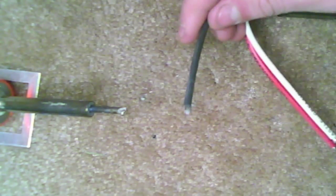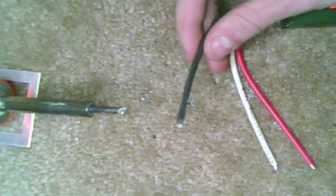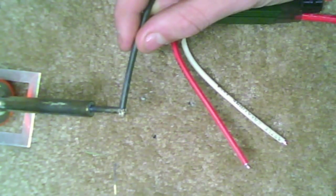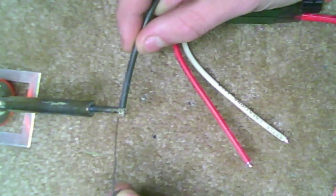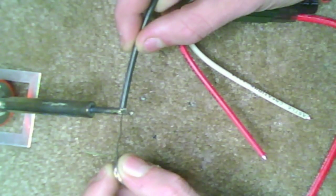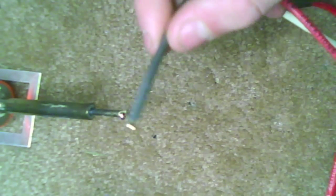The next thing we are going to go over is pre-tinning the wires. They already come pre-tinned but I like to heat the solder up and add a little bit more of my own, just so it flows and sticks a little bit better. Usually what I do — it can be a little stubborn — I take some fresh solder and put a little bead of it on the soldering iron. Then go ahead and set your wire on the puddle and you will see them flow together. Once they do that, give it a minute. Then you can touch the solder to it and it will tell you if it is ready. Go ahead and add a little bit more so it is fresher, and now fill up the wire — let it get a lot of solder on it — then pull it away. It is nice and shiny — a good pre-tin.